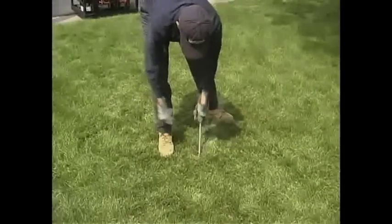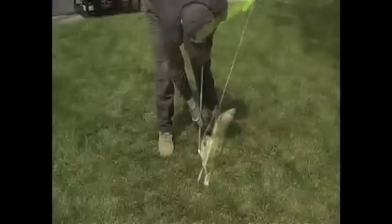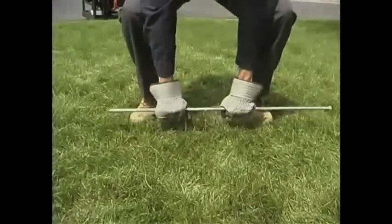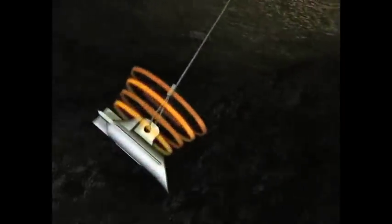Now you'll need to remove the drive steel. The next step is to lock the anchor. This is accomplished by sliding the drive steel through the cable loop and pulling upwards, which rotates the anchor underground into undisturbed soil, causing a cone effect to take place.